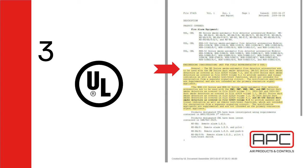Third and most importantly is our UL listing. UL tests our products for life safety, and as such they only test compatibility between our duct detectors and our remote key switches. This goes for System Sensor as well. By mixing and matching different devices, you lose this UL listing, which may cause your installation not to be written off by an AHJ.